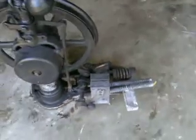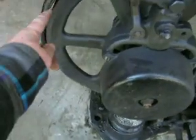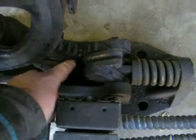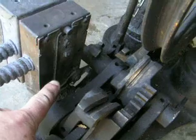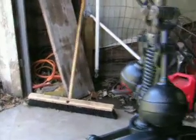The way you see it sitting right here is the normal operating position. The governor rope with steel cable comes up and winds around this pulley here, and down between these two jaws right here, and then on the back side of this — it might be kind of hard to see with the light — there is a lever here with a trip on it. During normal operation, the governor spins and the weights fly out against the tension of the spring there.